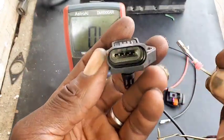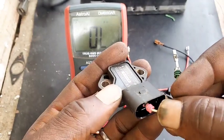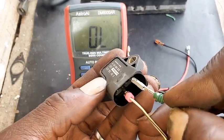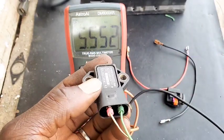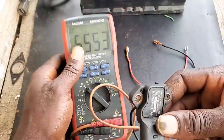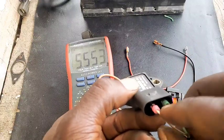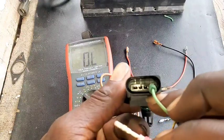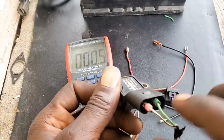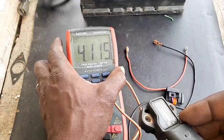Remember, one and three, and one and four. You can also check one, three, and four too — we'll be absolutely sure. We are live. What we have here is 5.5K ohms, which is pretty good and stable. Now I'm going to test between pin 1 and pin 4. We have it on pin 1 already, so let's go to pin 4 and see what we get. Almost just about pretty much the same — 5.4K ohms.